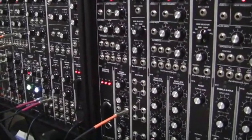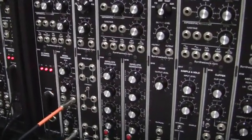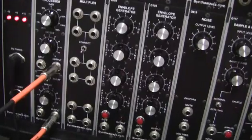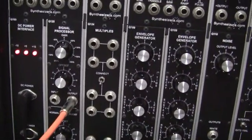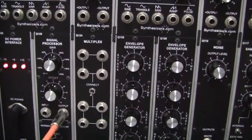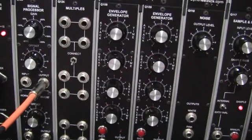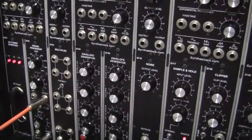To alter the frequencies across the multiple ranges required, I've got the oscillators using my signal processor here. You'll notice those two orange cables coming out of the signal processor — I've got them feeding into the one-volt-per-octave control of the oscillators, and I'm using the offset knobs to control the frequency of both of them so that I can adjust it from multiples.